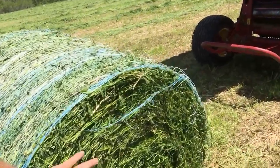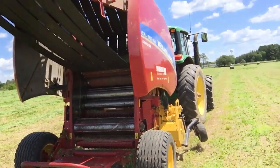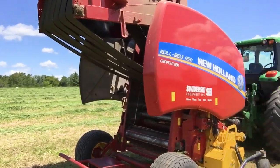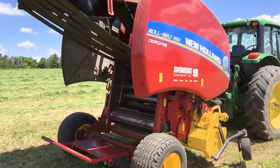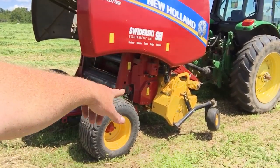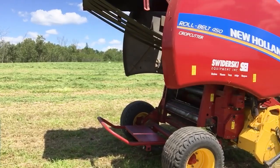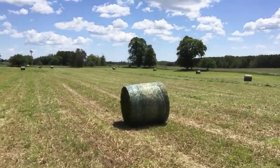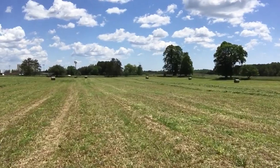Lot of adjustments. The last thing I made out of this baler, if I'm not mistaken, was sorghum. I knew I had to make adjustments anyway, but we're talking about a lot of them. I've adjusted the pressure 3 or 4 different times. Inside, outside, we're talking density here. The pickup head, I had to lower that twice, respectfully, without hitting the ground. I'm having to skim it, especially on single row where I didn't rake them double.